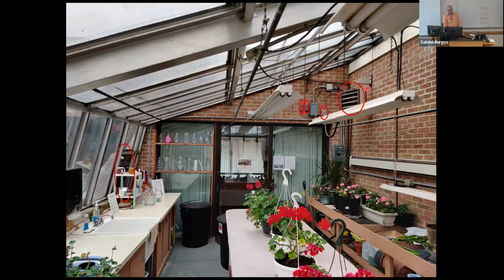Up in here, this is a small electric heater with a fan in it. And there are 2 baseboard heaters below there. And those 3 items, the exhaust fan has a thermostat here. This is the thermostat for this fan, and this thermostat is for the baseboard heating. And they all have to be adjusted right. When we were having a problem, I would go there and the heater would be on and the exhaust fan would be on, and that isn't good. So what we needed is a temperature logger.